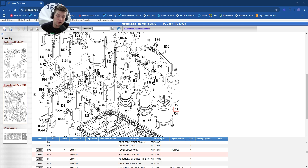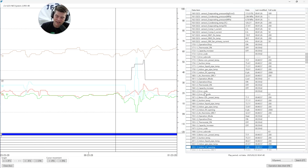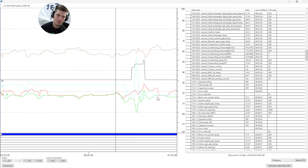So this accumulator is now full of liquid refrigerant. What happens? It starts to bubble up - a little vapor, a little gas flows out and goes into my compressors. The compressor suction temperature thermistor right here is telling me that leaving my accumulator I have liquid refrigerant - so it is full. That's the only explanation. If refrigerant is at saturation temperature right at the compressor after passing through the accumulator, that is a full accumulator - liquid is spilling over the top.